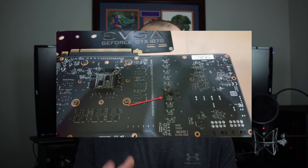A while ago, an issue was discovered with EVGA's ACX 3.0 cooled graphics cards — specifically one of EVGA's SuperClock 1080s. The issue was with the VRMs on the GPU; they didn't do a good enough job actively cooling them, so they had issues overheating, and in some cases they would physically burn out and you could see burn marks on the PCB.